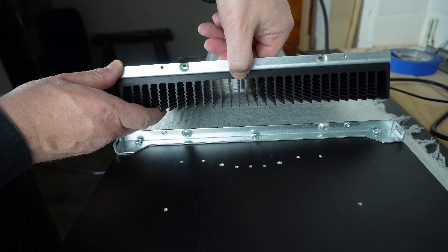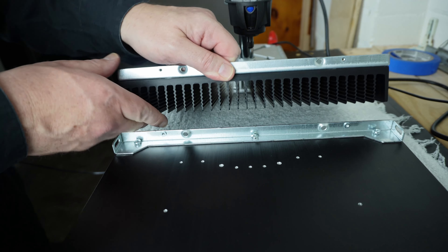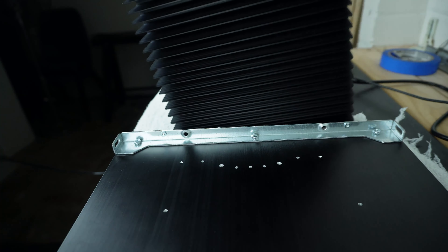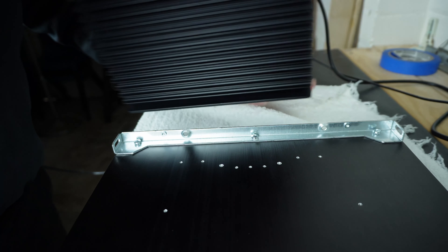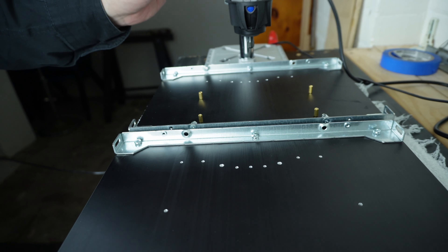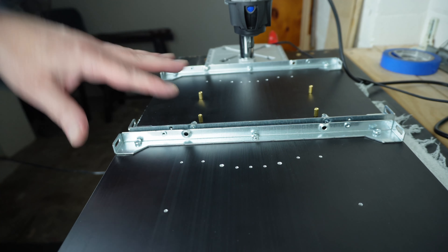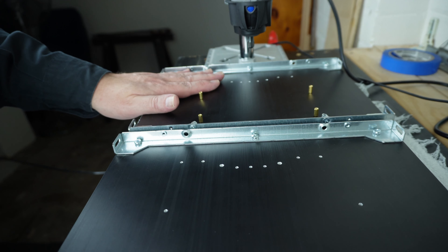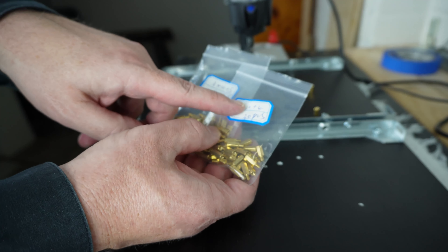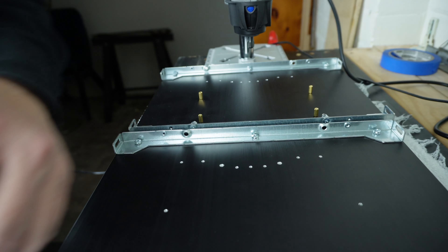The aluminium itself is quite thick and I didn't want to go through it — the very first tap I did produced a hole that was a little bit short, but the rest have turned out really well with beautiful tapped holes. On this side of the heatsink there's nothing to be seen, so it will look absolutely fantastic in the amplifier. The drill press is really important for making sure the holes are straight. Also consider the variable thickness of the transistor packages being mounted.